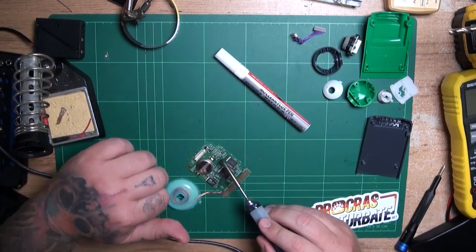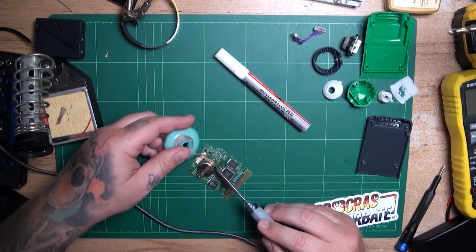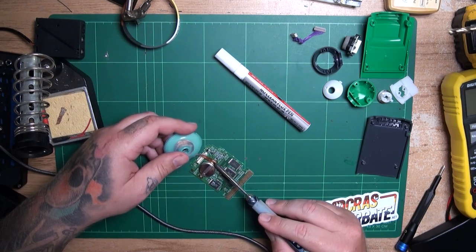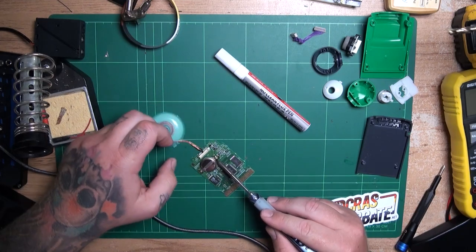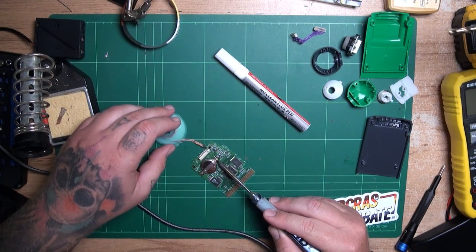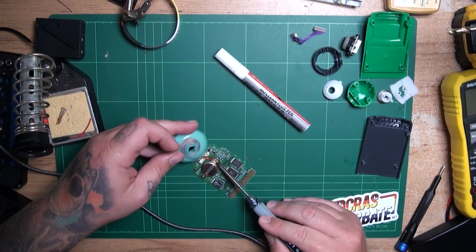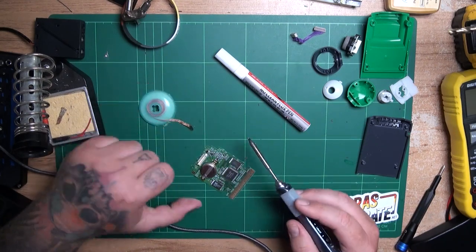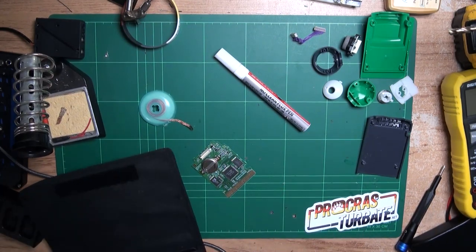I'm going to remove the existing battery using a combination of heat and soldering braid. You'll need some special CR2025 batteries with the tabs. These are usually pretty plentiful on eBay, however your quality may vary. Unfortunately there's no legitimate supply for these batteries because of those annoying little tabs. You might be able to find a way to use a standard CR2025 on the PCB but it will require a little bit of hacking. Anyway, I've used some from an Australian eBay seller — hopefully these will work fine.